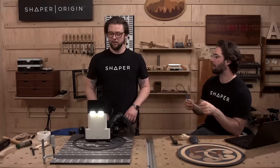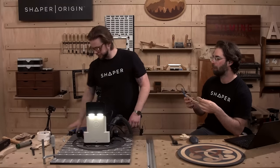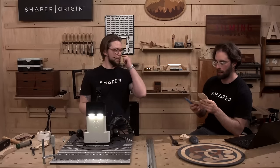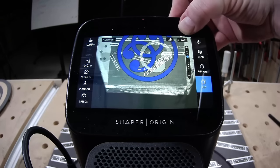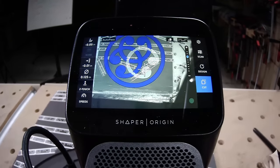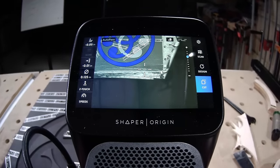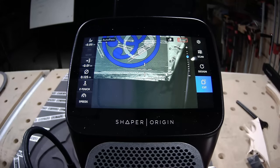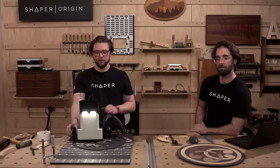And we talked about adding to scan on the last show, didn't we? We did. But if you're curious about that, why don't we point out the tape meter and also where you would add to scan in case folks run into this problem. So the tape meter is right up here. It's the domino in the top right corner. And as I move around, it should be solid black. But you can see when I get down here, it starts to go red. In most cases, when that tape meter goes red, it's going to retract the tool. But if you see that red, that's kind of your warning before that happens that you should retract on your own and add more tape wherever you can. For our purposes right now, that's going to be just fine, though, for the rest of it.